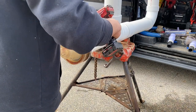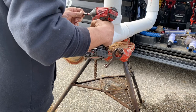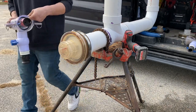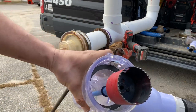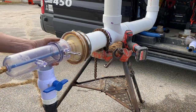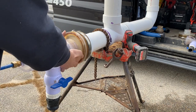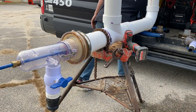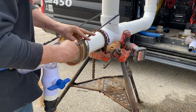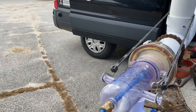It simply slides over — you want to make sure that your cap is centered so that you're able to drill it out. Use the nut driver to attach and get it nice and tight. Then grab the body — you want to make sure there is a gasket inside of it. The hole saw goes through the middle right onto the clean-out cap. Attach the body by connecting and clipping on the sides. There's a bungee strap that comes around to help secure the tool if you feel you need it.